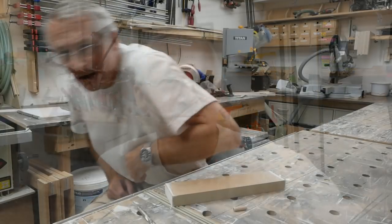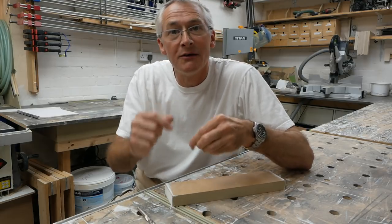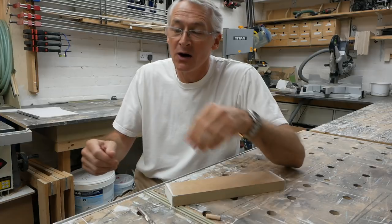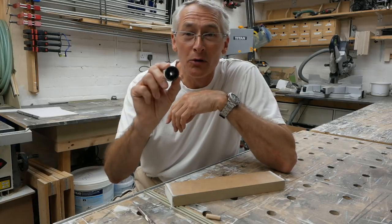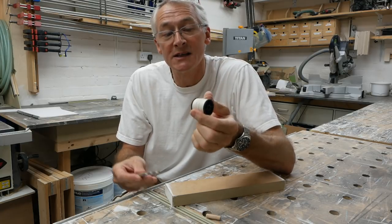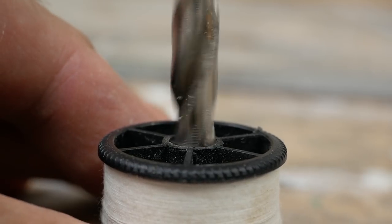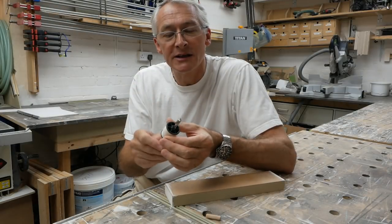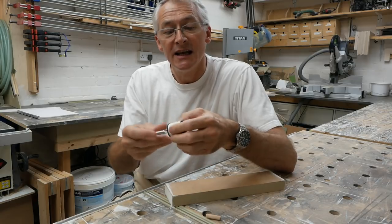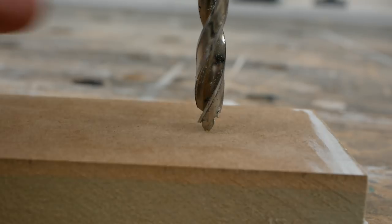What I've found is that a humble cotton reel is almost the perfect thing for the job. Whenever I need to pop a quick hole in something it's usually to hold a dowel that needs to be perfectly perpendicular, so that means a six or eight mil hole. It turns out the humble cotton reel has a near perfect eight mil — or sometimes seven mil — hole in the centre. It's a little bit snug when you first get it going, so you need to be a little careful when first feeding an eight mil bit through, but once it's in it's almost the perfect guide for this kind of simple one-off hole drilling.